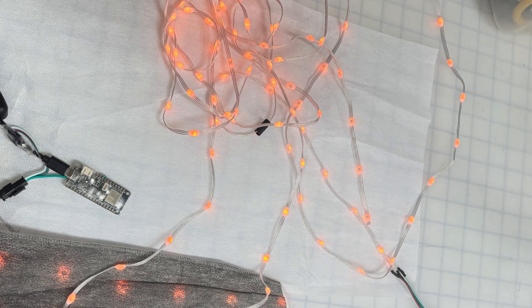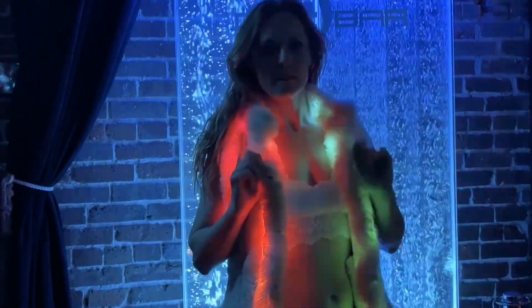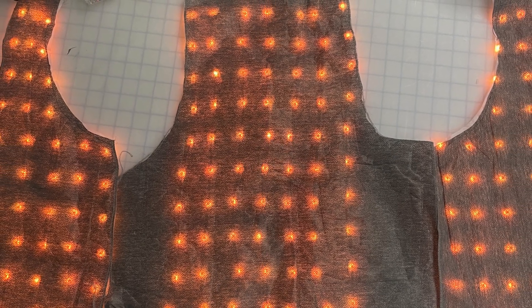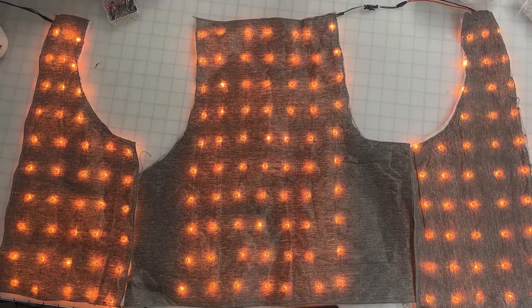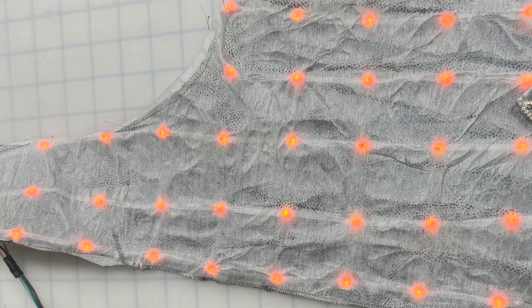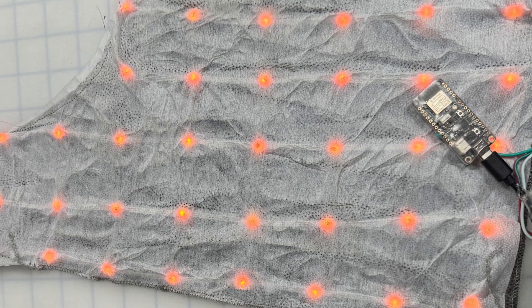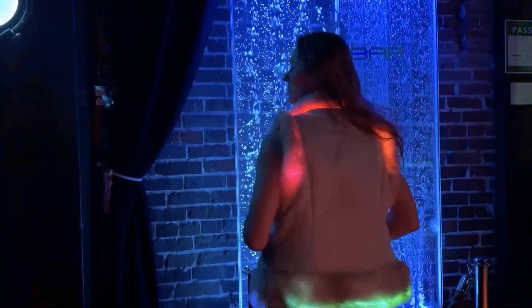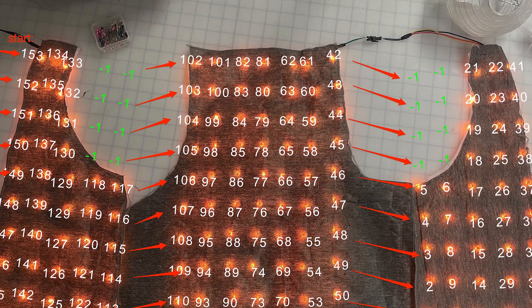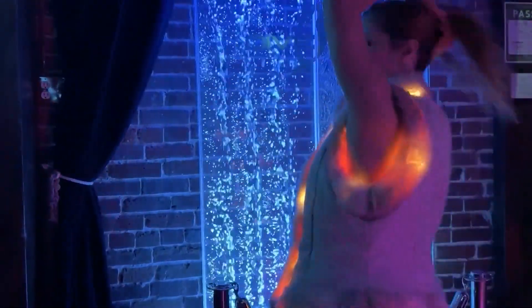Erin lays out the project so that you can take it a few ways. If you want to keep it relatively easy, you can embed LEDs in the trim of your jacket and control different animations using your phone. If you want to increase the wow factor, she shows how to create your own flexible LED matrix panels to really light up the whole coat. This is a bit trickier and involves defining an irregularly shaped map table for the matrix and uploading that map to the WLED software — otherwise, the grid of LEDs will be all out of order and your animations will look super random. As a third option, she shows how to combine both the trim and the panels, mapping the LEDs so the trim behaves one way and the panels behave another. But man, what a payoff.